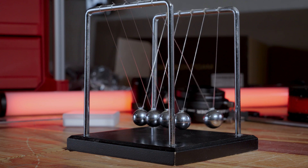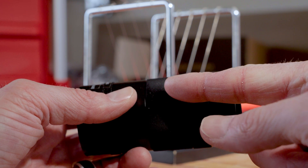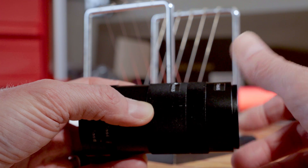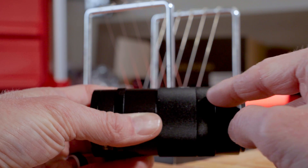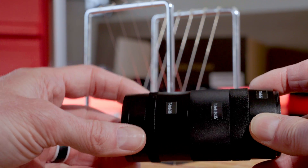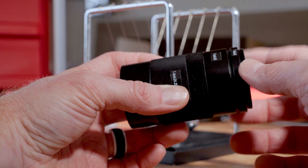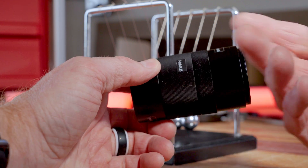This is a Newton's cradle. Its purpose is to demonstrate the law of conservation of momentum. If I spin these outer rings, you can see that they move freely without moving the inner ring. But if I spin them hard enough that they bottom out, they'll transfer that angular momentum into the next ring and cause it to move too. The idea here is that when you're screwing your parts together and they bottom out, some of that energy is transferred into the next ring in the line, causing it to turn and tighten a little bit more — all the way down the line, just like the Newton's cradle. So when putting telescope parts together, I always try to put the smallest ones on last. That way when they bottom out, they transfer their angular momentum to larger rings, which are easier to hold onto and therefore easier to remove.